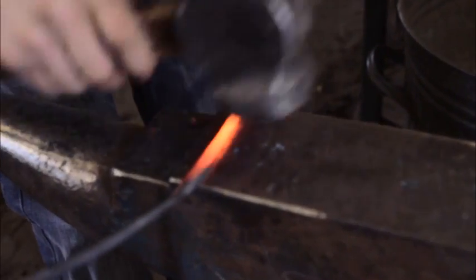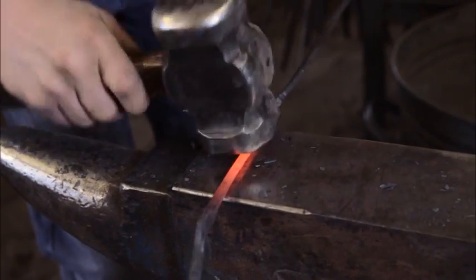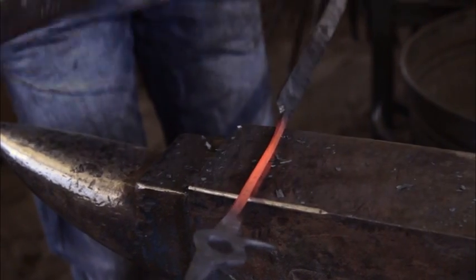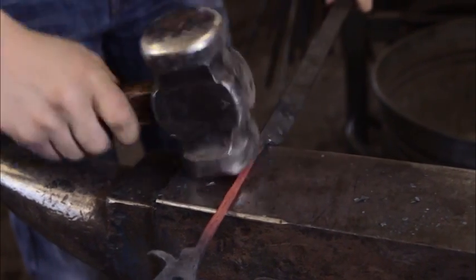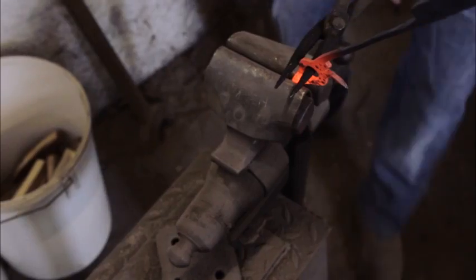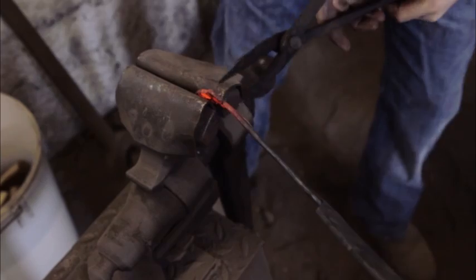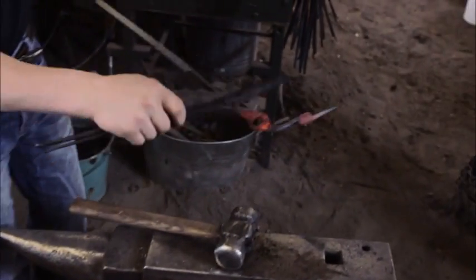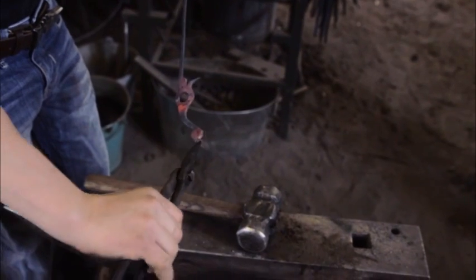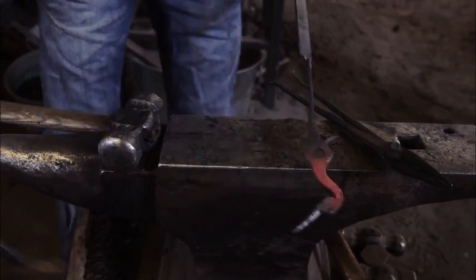But here, octagon, and I'm taking this around a roughish round. I say a roughish round because you can see I'm moving up a lot, blurring the hips. And bend it a bit like that. There we go. Yeah, that about. That's not going to make really. Next heat. Heat here, grab this in tongs and go. Should bend just there. There we go.